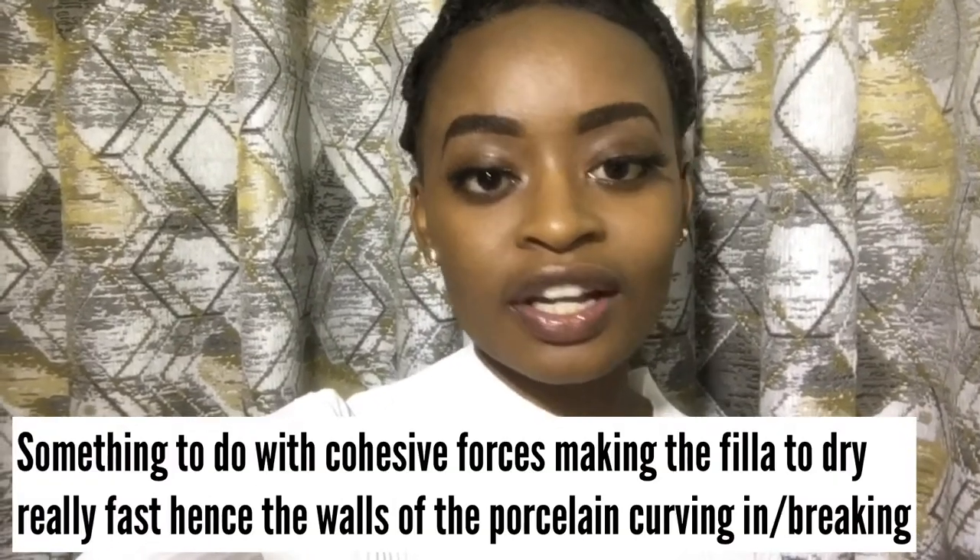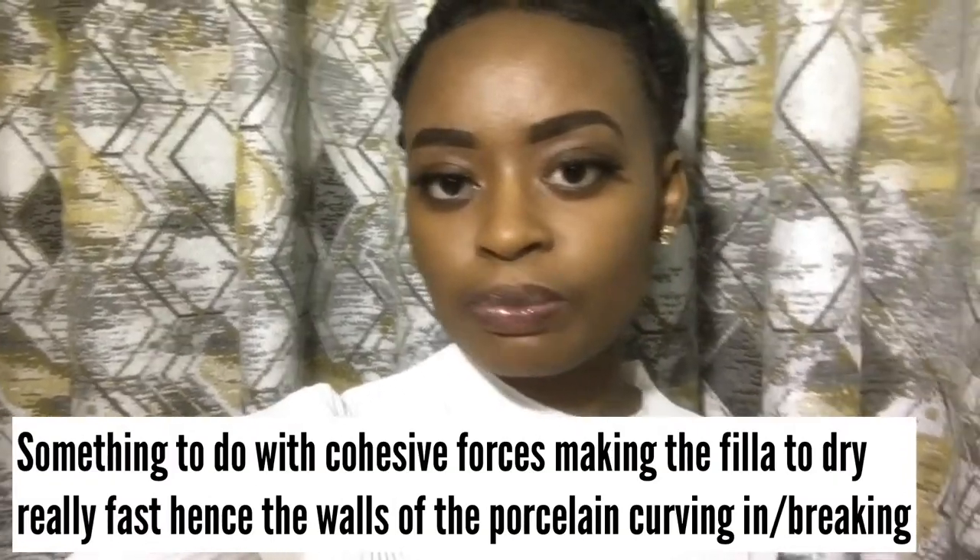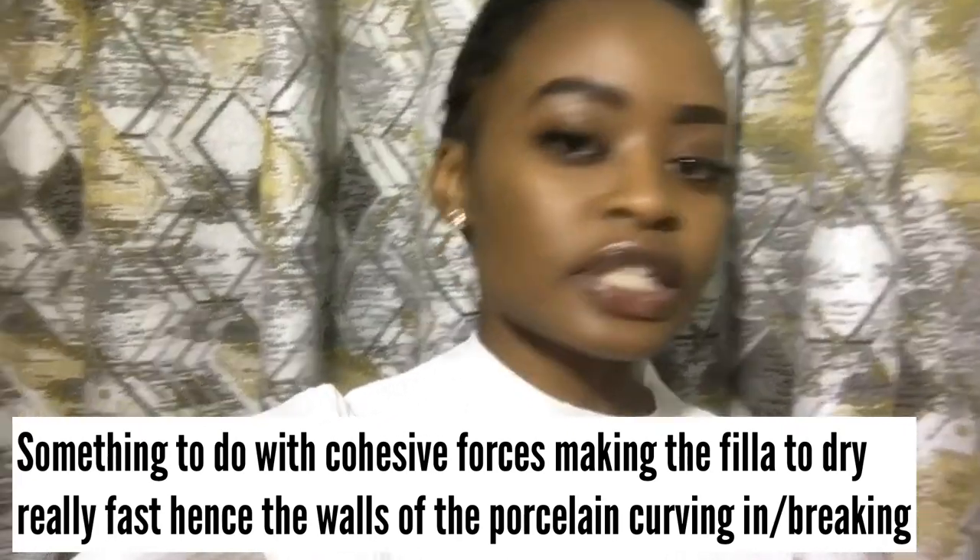So I'm back from filling up all the holes — I can't actually find my microphone, that's why I'm in selfie mode. What I've learned throughout the whole process: first, I mixed up way too much filler, so mix it in small portions. Second, don't mix in a porcelain container — I mixed in a porcelain one and it broke in only 3 minutes. Glass works the same way, so just use a plastic container. And that's it for today's video — don't forget to like, share, and comment down below, and subscribe to my channel and hit the bell button.